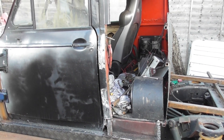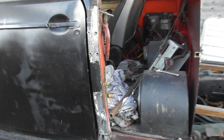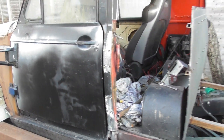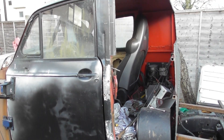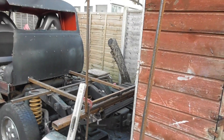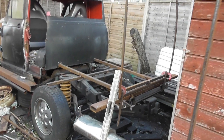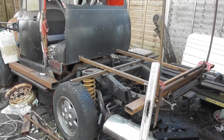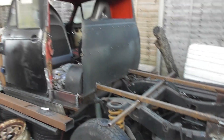Generally, I don't really know fully where I'm heading with this. We've got a flat surface there but I haven't got any angle iron wide enough - I've only got this stuff. I could chop that down and weld the flat edge on the inside edge all the way up and then shape the blunt edge accordingly. I would like to do wood at the top - I ain't going to deny that could look quite nice and would be in keeping with what I'm doing. The bottom half really does need to be solid steel and needs to be flush all the way through because of the wheel arch - otherwise I'd have to put wood all the way around everything, and that's too much.